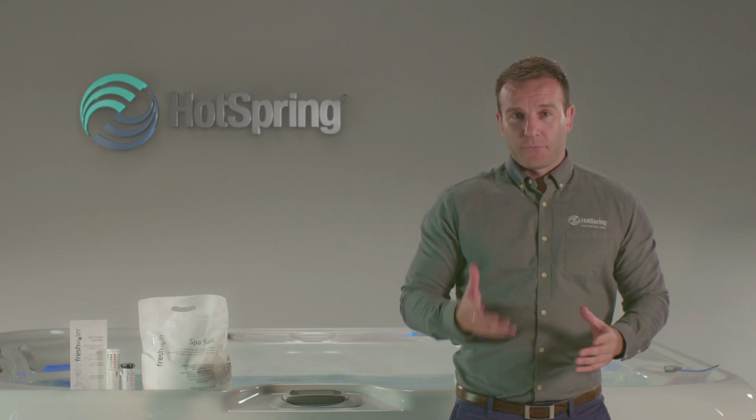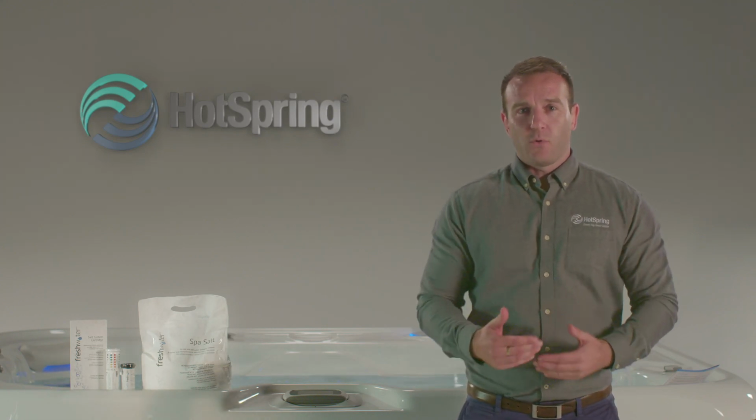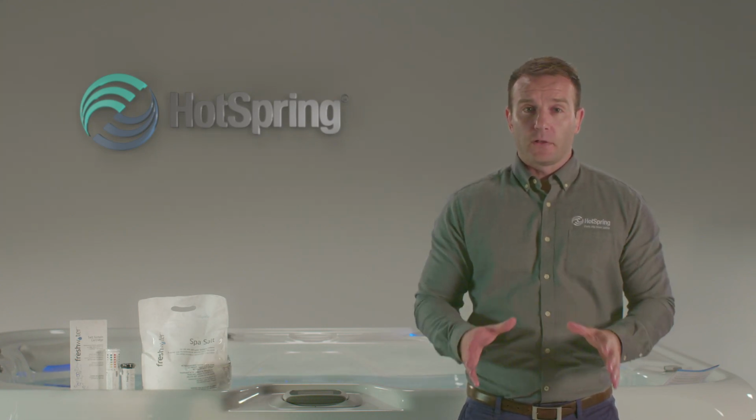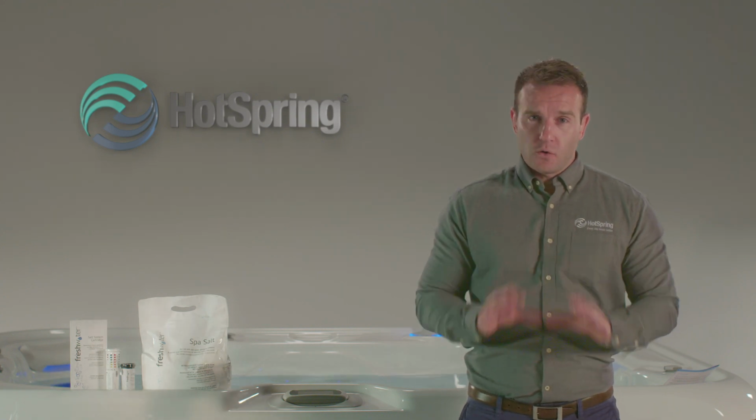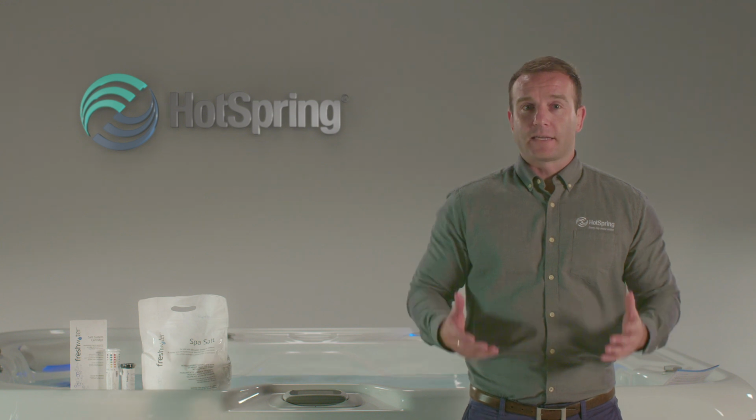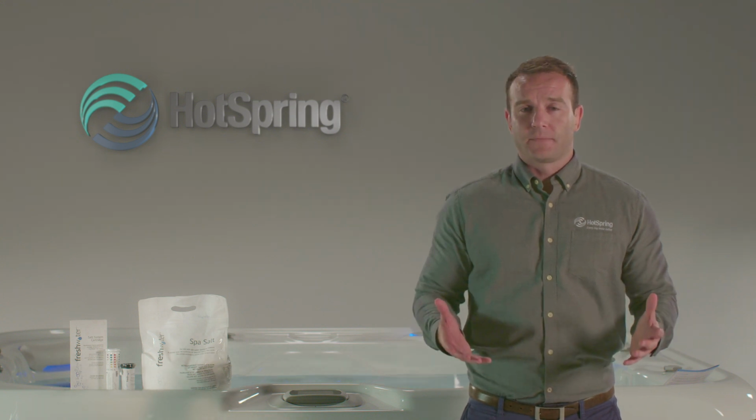Before starting up your freshwater salt system, it's important to understand the makeup of your fill water. Talk to your hot spring dealer to understand if the water in your area has high levels of calcium hardness or metal content. If you do have high levels of calcium hardness or metals in your water, you'll need to adjust them before getting started.